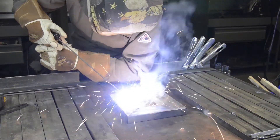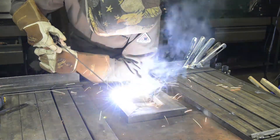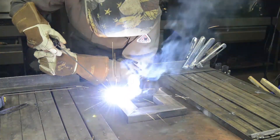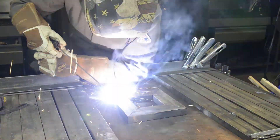When using a contact rod, you want to make sure that your electrode stays in contact with the base metal the whole time. When using a non-contact rod, you want to stick out at about an eighth of an inch. Remember your electrode is consuming itself, so your hand is moving closer to your workpiece.